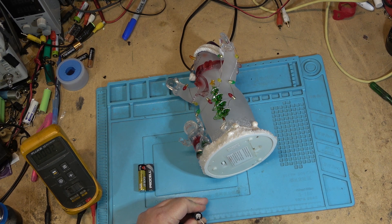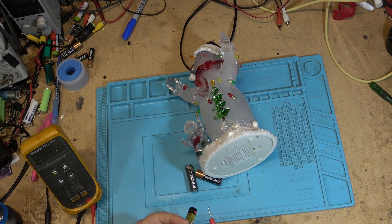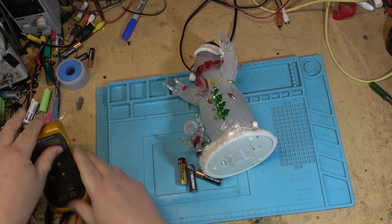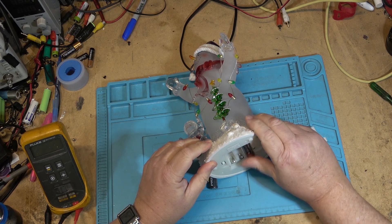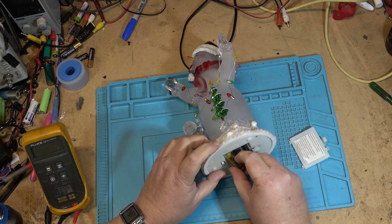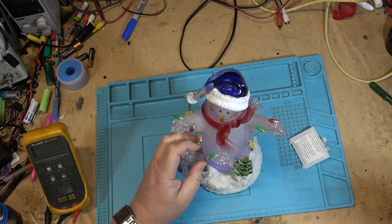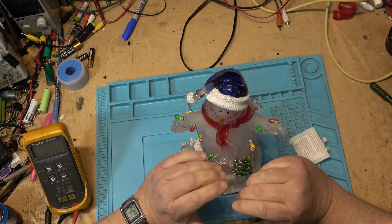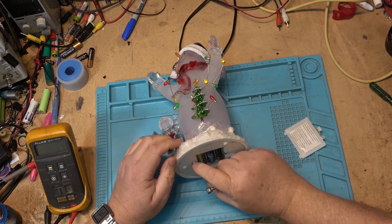Here's another one — this one's at 1.49, that's good enough. And an old EverReady Gold Nine Lives battery at 1.56. So these three batteries are good. Let's try the batteries in here and just see whether anything lights up. I'm sure the person that gave it away already tried batteries and it didn't fix it. And it doesn't — oh wait, is it lighting up? It is lighting up! Not very bright, but we'll open this thing up and see why it seems dim.